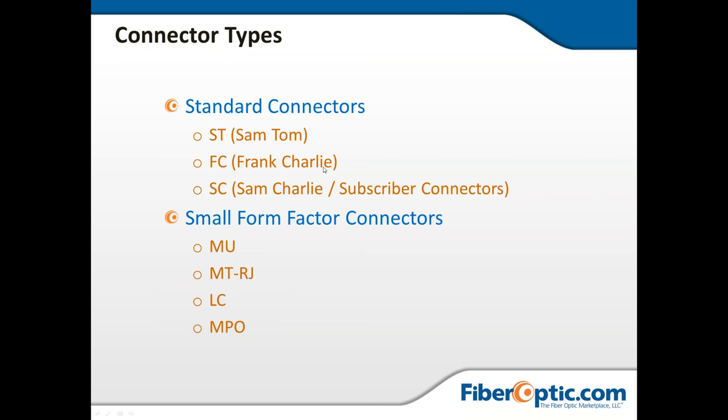Frank Charlie, the old FC, is a fiber optic connector with a threaded body. Single mode optical fiber, maintaining polarization of optical fiber. It's really designed for high vibration environments. The Sam Charlie, the standard subscriber connector, is a fiber optic cable connector that uses a push-pull latching mechanism. I like this one.